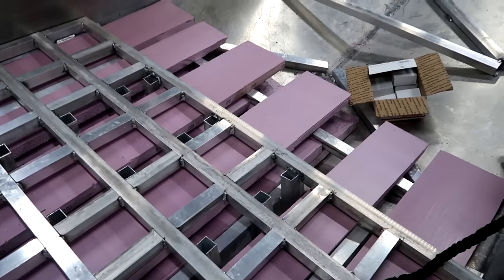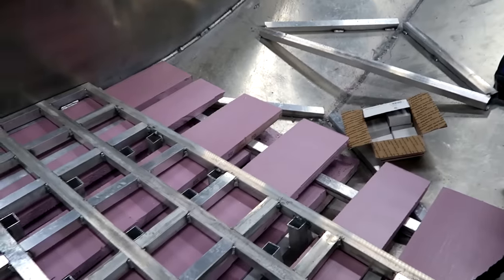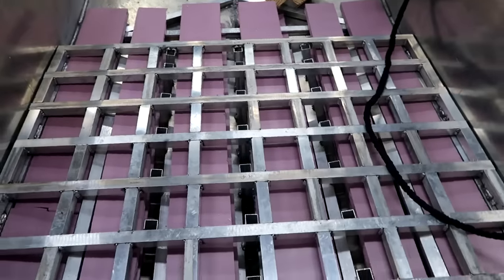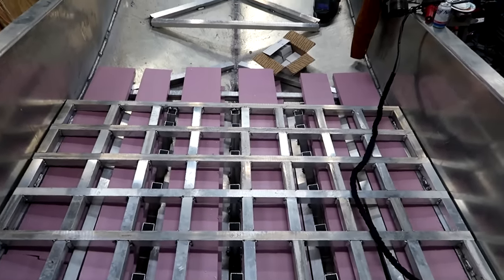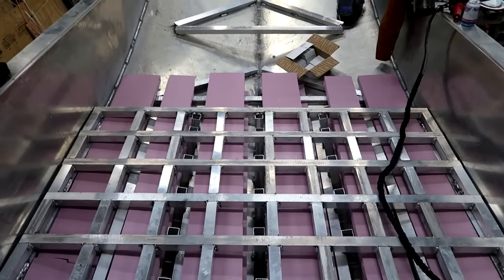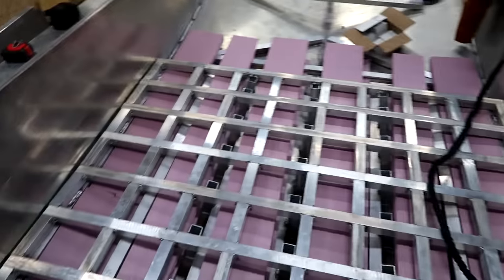Make a 10 inch tall step, split the difference — it'll be all the way across, you'll have a 10 inch tread basically, which is a nice landing, and you can step up onto the front deck. That's the plan now. Spent quite a bit of time on this subfloor — there's a lot of work here and you'll never see it once the floor is on, but it's good to have a solid subfloor, just like building a house. Fuel tanks and everything, as far as I'm concerned right now, is going to be housed above this deck. I want to have this completely sealed off, basically make two separate levels, and whenever I weld in the floor I'm going to weld it 100% all the way around the boat to keep the bottom as dry as possible.